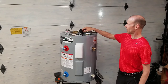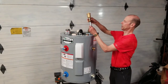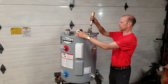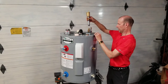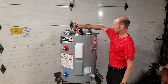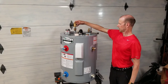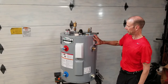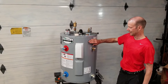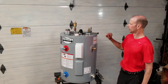Once the anode rod is removed, it's a perfect spot for an automatic air eliminator, installed with tape on the threaded pipe. It's a four-inch piece of pipe with three-quarter inch tapered thread — you can get those pipe sections at a big box store for about three dollars each. There's about a four-inch gap from the top of the pipe to the roof of the tank, so bubbles rise up and the automatic air eliminator solves that problem.